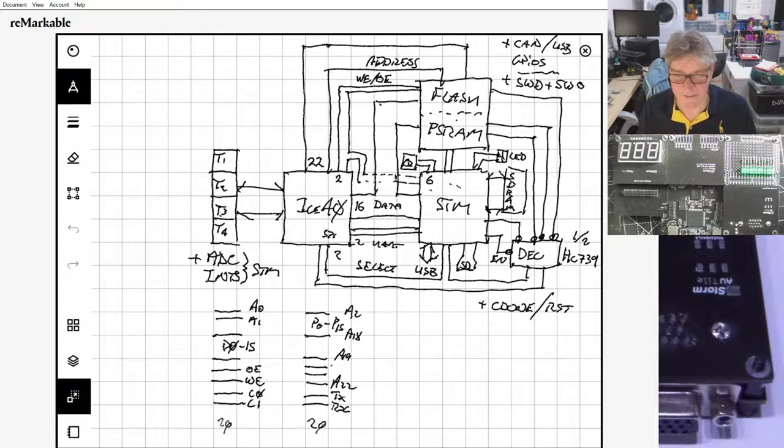And I've had lengthy discussions with TNT about this in order to get the pins optimized for the HyperFlash, because the way that the HyperFlash bus works is it's very sensitive to timing. And in order to get a decent response on something like the ICE40, which has limited capability, you need to optimize for the pins that are available. Sylvain, TNT, has a really good insight into the ICE40 and the IO architecture and the blocks around it, and he can really look at the best way of optimizing how that works. So we've already chosen the pins.